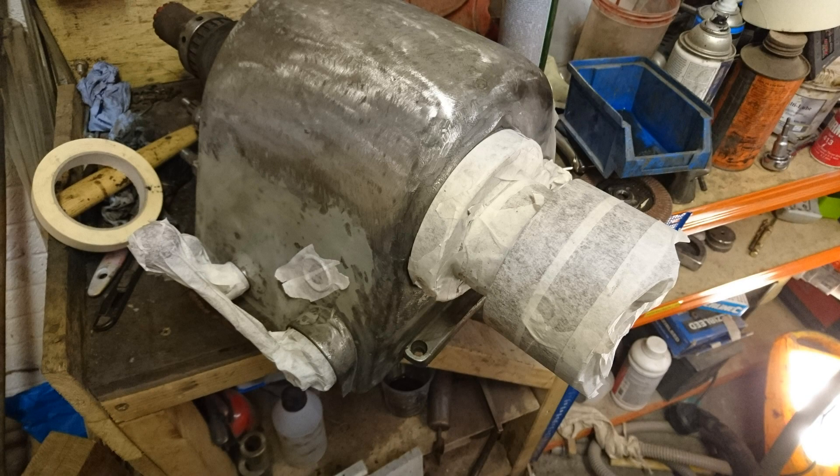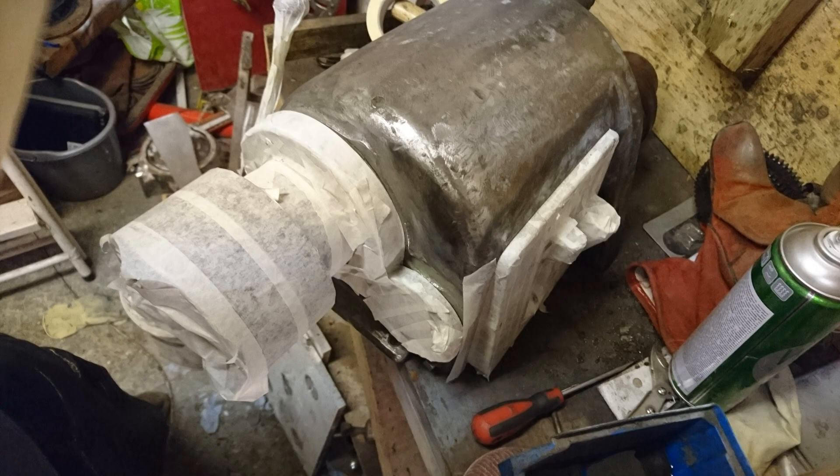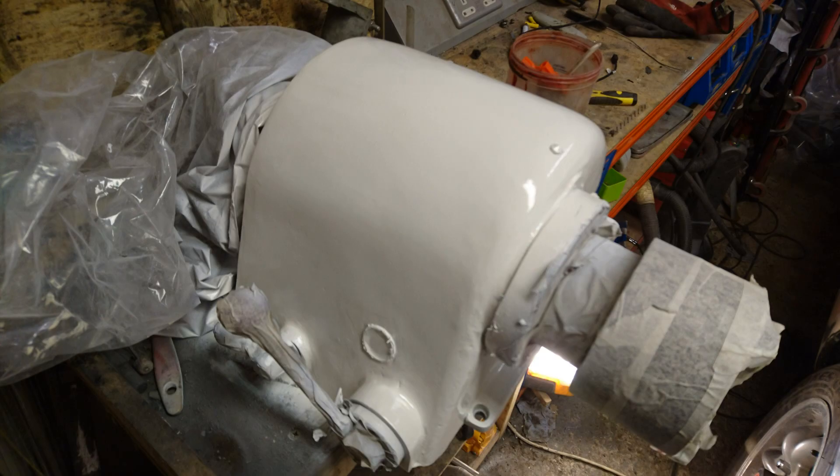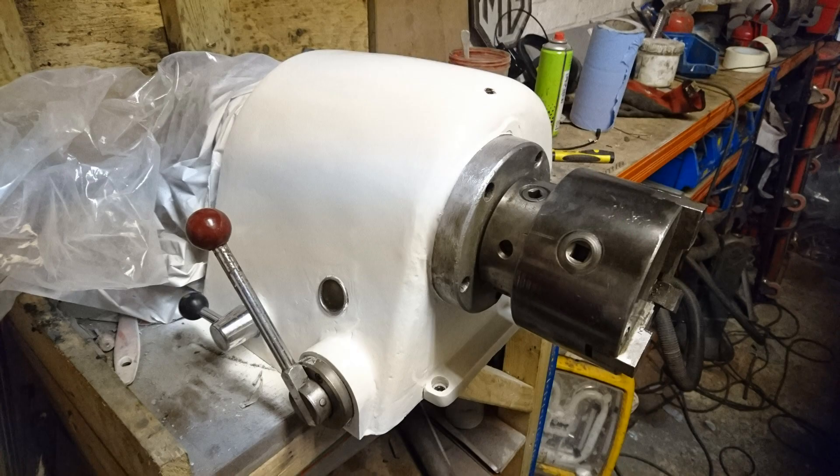On the headstock, I didn't go too far with this, because the spindle bearings are extremely expensive — you're looking at about £700 for a set of bearings for the spindle. So I decided against completely stripping it down. It felt good, there was no play in the bearings, so I just cleaned it up, gave it a fresh coat of paint, and it came out really nice. All the oil was replaced as well.